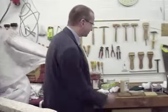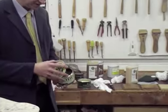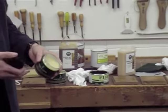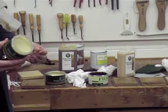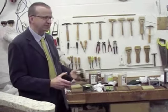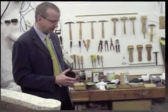The other wax we mentioned, which goes on top of shellac, is this one here. I've brought up a tinted version called English Oak and a clear version called Mellow Wax. There's a lot of beeswax in these — they're very traditional antique restorer-type waxes. They're slower drying because they're pure turpentine-based and beeswax-based. But if you've got an old table at home that you're quite happy with and it's got the odd scratch, you can put the wax on top and it can work nicely.